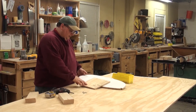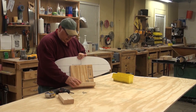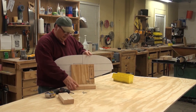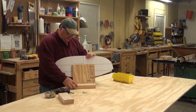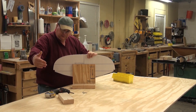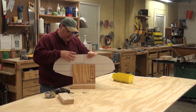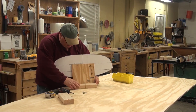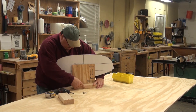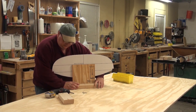Now we've got our tab connected to our form. The buttress block goes on the side opposite the face — because when measuring on the boat, we always want to measure face of form to face of form. It's a lot easier than trying to measure center or any other way, so I don't want to obstruct anything. I'm lining up this two-by-four block, center lining all the way around, and attaching it to the tab.